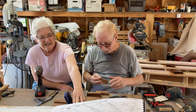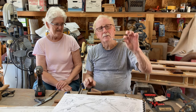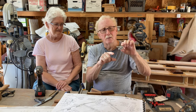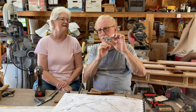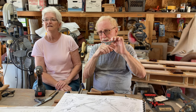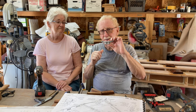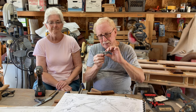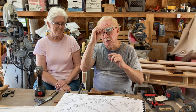We took a real cleat and took measurements off of it. There's a little hole down in the bottom — in order to keep the lashing line attached to the hull all the time, there's a knot you tie in it, and then you wrap it around five or six times around the aka beam and then tie it off on the cleat.